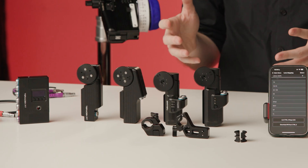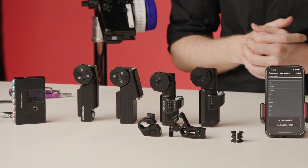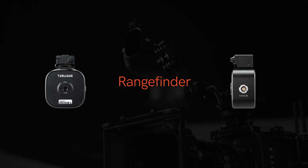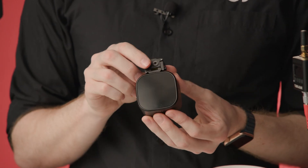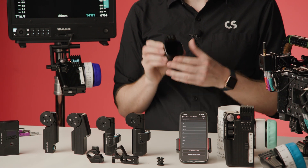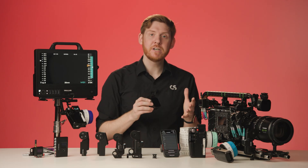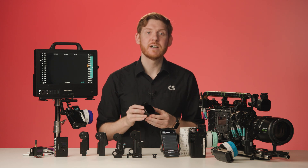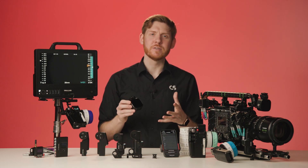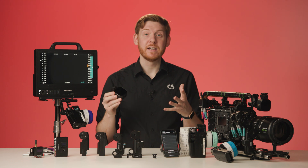There are also different size gears for specific lens needs. Daisy-chained to these motors is the TOF1 rangefinder — a small, lightweight infrared rangefinder that provides constant distance measurements between objects and the camera's focal plane. With a sensor refresh rate of 60 times per second, precision autofocus can be achieved on your handset with a simple on-off toggle. LED infrared beams measure the distance of a subject within a three-degree field of view at up to 80 feet line of sight.